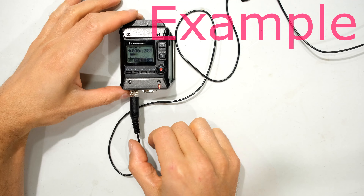Now I'm going to work with the cable here, just checking the length. We don't need the signal wire so long, so I'm just going to strip it a bit. If you've got wire strippers, rather use wire strippers. Now I'm just going to put some solder onto it — the signal wire has been tinned. Tinned just means it's got solder on it.